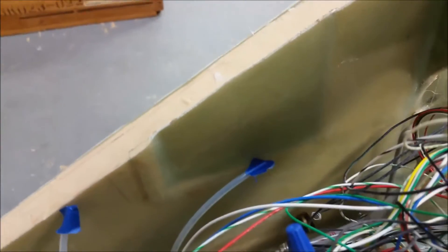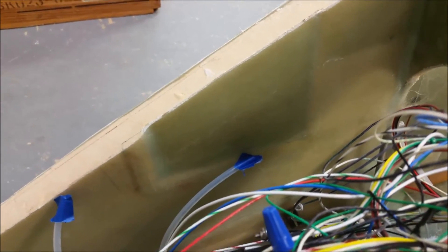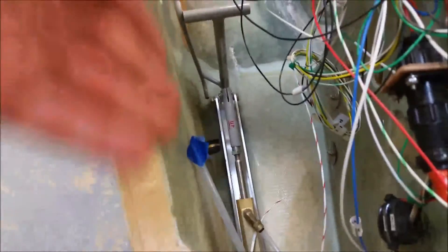One other thing I wanted to show you: this is the pad right here — a five BID pad covered with another three plies of BID. That will be for the Atkinson pitch trim. You can see it's notched out a little bit to make a more straight line underneath here.